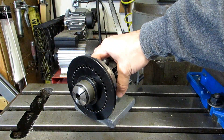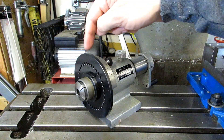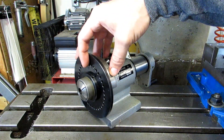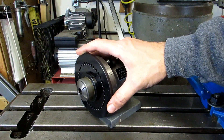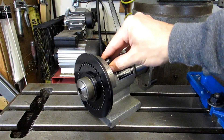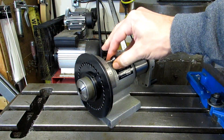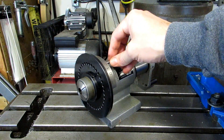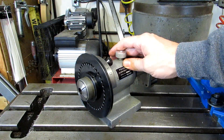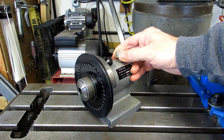Now I mentioned that these were meant to be used on a surface grinder. A lot of people do use these on the mill, but you end up with a lot of clearance issues between the spindle and the plate right up here. As you can see, the collet is quite close to this plate when it's drawn all the way in. You're going to have to make sure that you have some kind of long tool holder to avoid running the tool into the indexing device. I wouldn't recommend taking very heavy cuts on this if you're going to use it on a milling machine because this pin is just held in there by friction — there's a slight taper to the end of it but there's really not a lot holding it in. So please make sure to take light cuts so the pin doesn't vibrate out, and lock the spindle lock down before you make your cut.